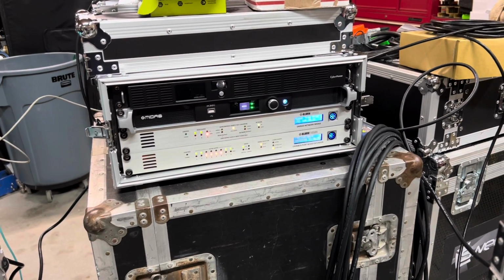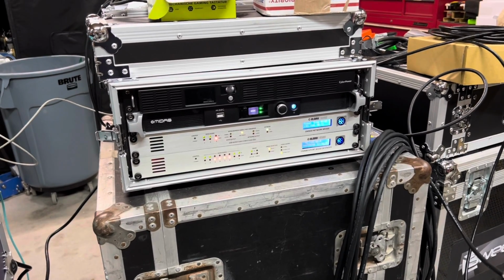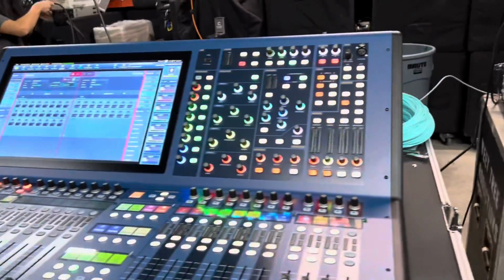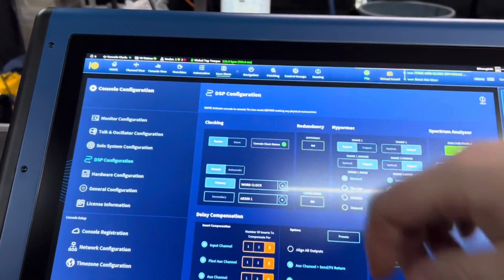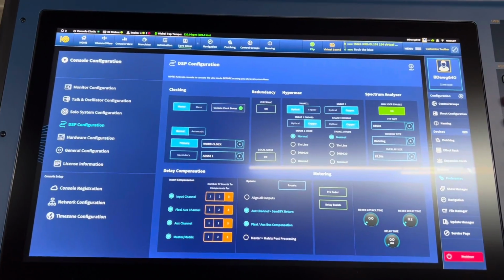So first thing first, on the 9680s and the 9650s, you do have to set them up and do a firmware upgrade to where they are compatible with the Heritage Ds. That's in another video that you can find on our channel. And after you get that set up, what we have found out, which is pretty cool, I don't know if it's just with the Heritage Ds, you can switch back and forth between fiber optic and copper without having to go back in and reset the 9680.